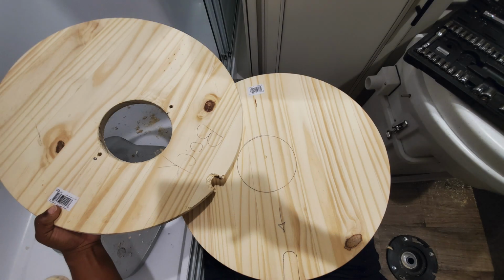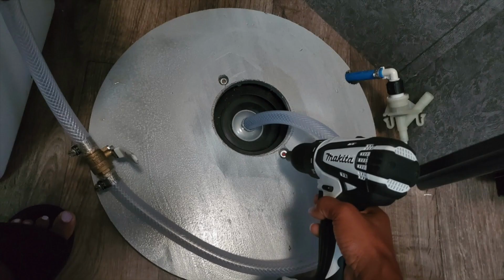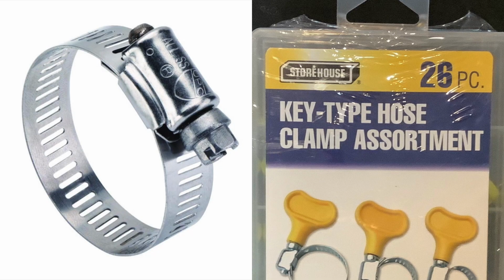We recommend dual markouts before you cut out the center hole in the bottom and the channel in the top layer. We use the 2 existing toilet anchors to fasten the bottom layer of the platform. Then we use 3 screws to fasten the top layer to the bottom layer of the platform. Use the same Gorilla Tape method to mount the brackets.